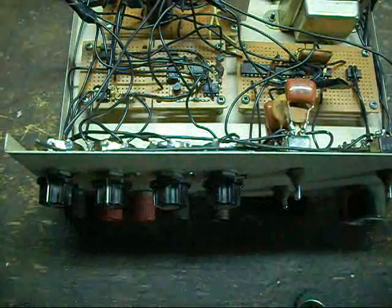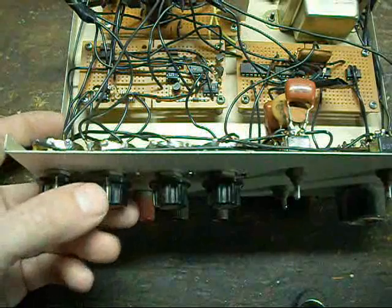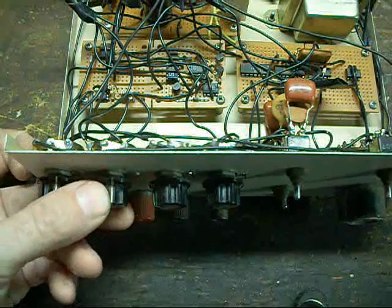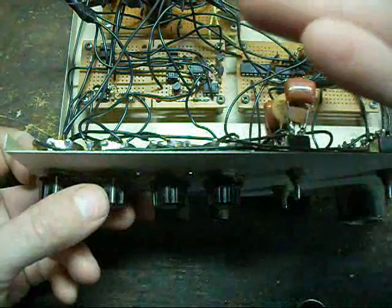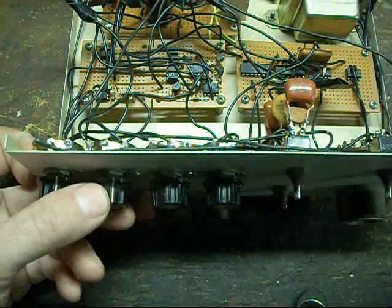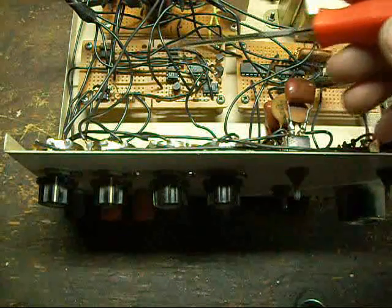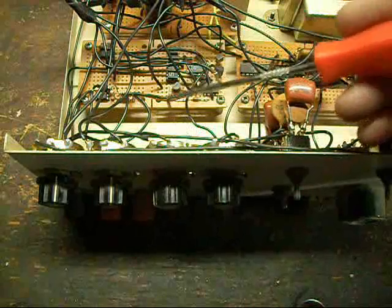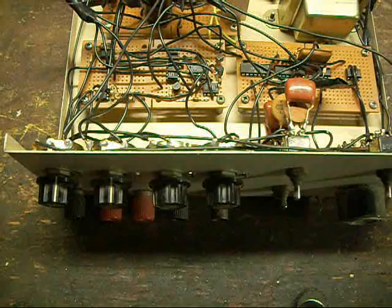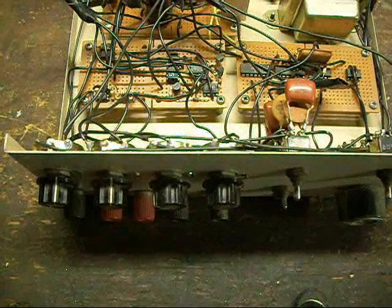This control adjusts the total amplitude while this one controls the DC offset — in other words, the voltage of the sine wave above or below DC ground. The comparator produces the TTL output to generate a pulse width modulated signal that does not vary in frequency as you change the pulse width modulation.